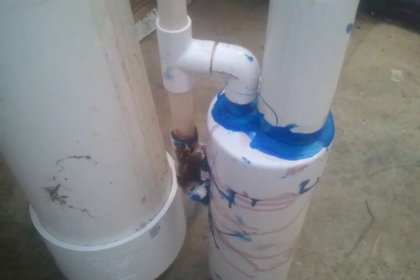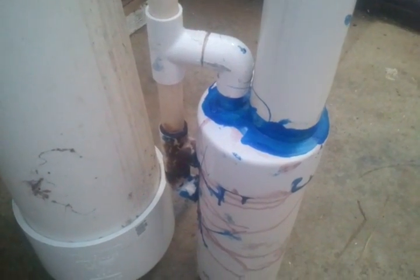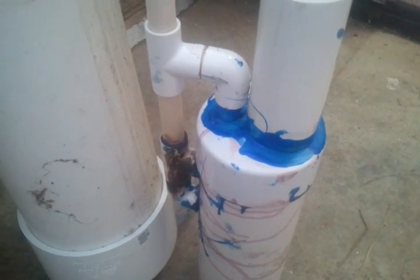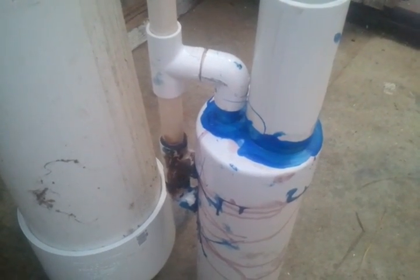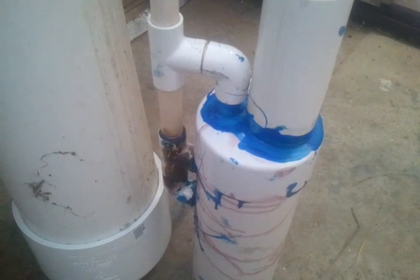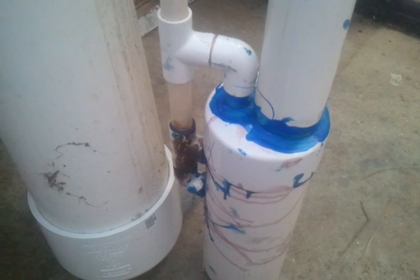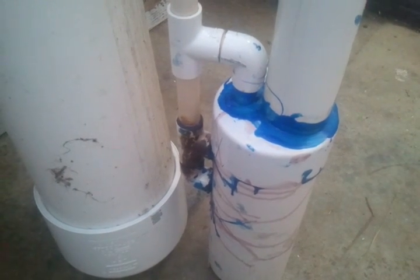So I had a lot of air going in there, but my calculations tell me that I can use a significantly lesser amount of air, and I'm sorry I didn't do that test, to find out how little air I can actually get by with. So 27 inches, 9-inch lift, I got 60 gallons per hour. Yeah, 60 gallons per hour. I did the same test with 2-inch pipes, same depth, same rise, same air going in, just a straight airlift, and I got 40 gallons per hour.